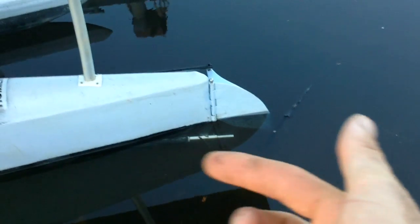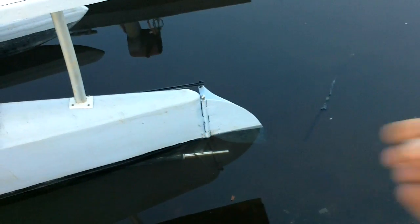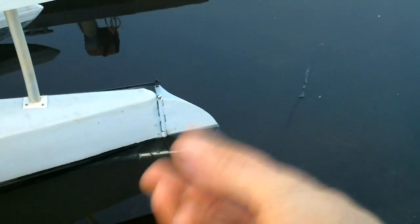The vibration was getting worse again and I couldn't figure out why. I went to eat dinner and halfway through I'm thinking — maybe there's something stuck inside the tube, or maybe the tube has a weld line that's unbalanced when it spins. So I checked another piece of tube and it looks pretty smooth with uniform wall thickness. Then I came back to see if there was junk stuck up in the tube, so I took the propeller off by removing the bolt.